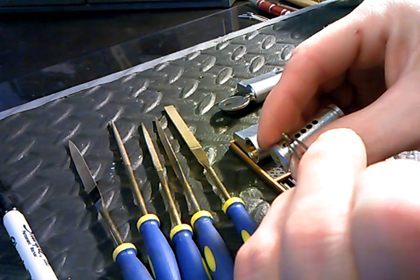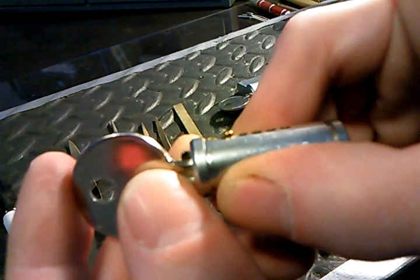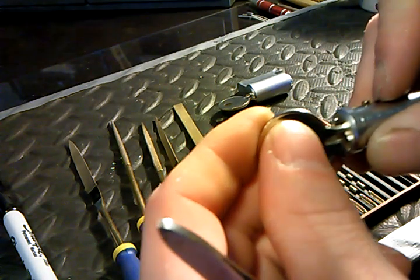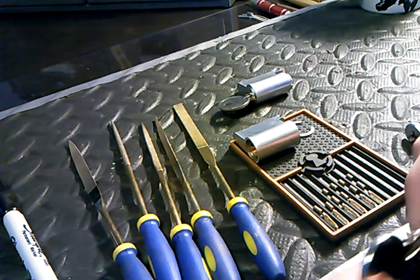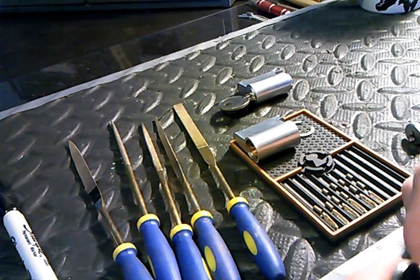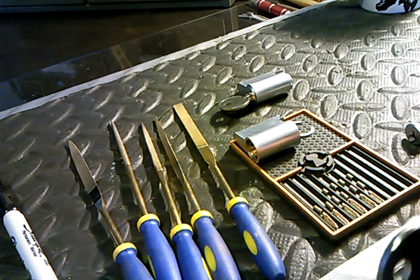Just pop that in there — I am a little coffeed up right now, I needed a boost. Of course it's a blank, so the second key pin is going to sit up a bit, and that gives me an idea of how much I have to file. Like I said earlier, we don't want to make enormous dramatic cuts — you're not going to lean on your file for five minutes and discover you made too much of a cut. It's better to make a hundred little ones that add up to perfection than two big ones that add up to a mess. I'm satisfied that the marker line is pretty much dead on center.